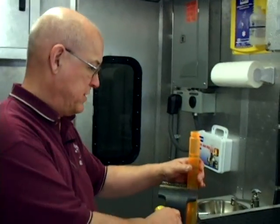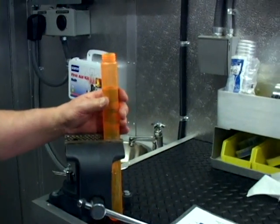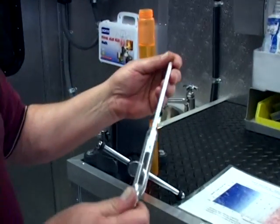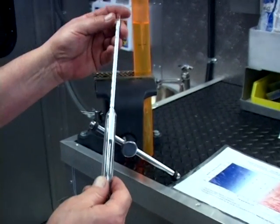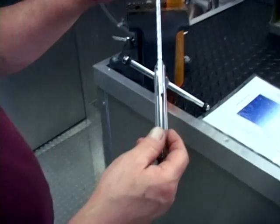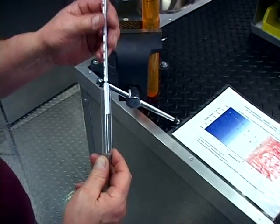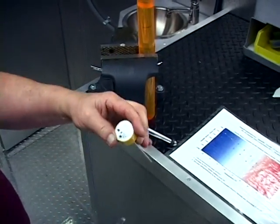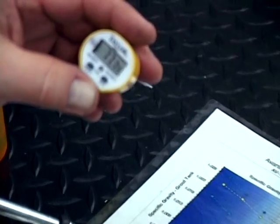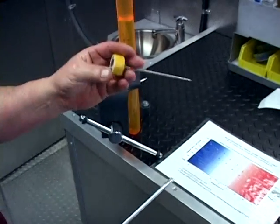This is a simple little device we put together — it's really nothing more than a tube that I got at Walmart in the kids' department. I just took a sample of the grout tank itself. I have a hydrometer here that you can get through McMaster Carr, WW Grainger, or any number of chemical equipment sites. It measures the specific gravity or density of liquids, in the 1.000 to 1.2 range. The second thing is a simple industrial thermometer. These two together total less than $50 — roughly $30 for the hydrometer and $20 for the thermometer.